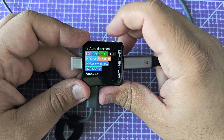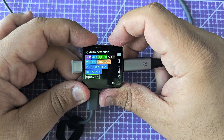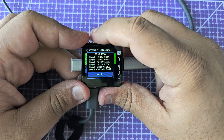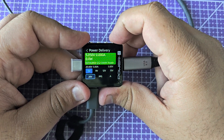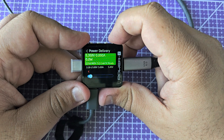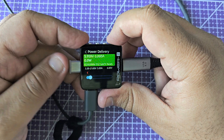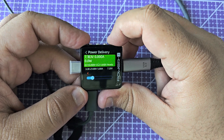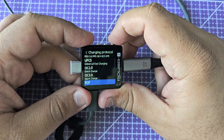As you can see, the interface on this device is much better than the last one we looked at, and there's a reason for that — it's a much newer device. Here is our Power Delivery trigger interface: I can switch between the fixed voltages, and I can go into the Programmable Power Supply mode in the green bar above right here. This is giving you the real-time readout of the voltage, current, and wattage. Because nothing is plugged into the output side right now, it's reading zero volts and zero amperes, but if anything were plugged on the other side it would show exactly what's going on.